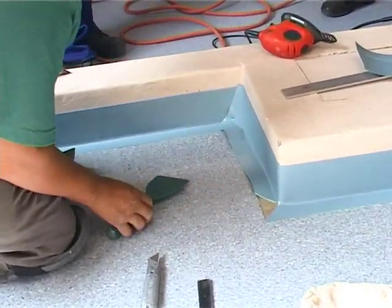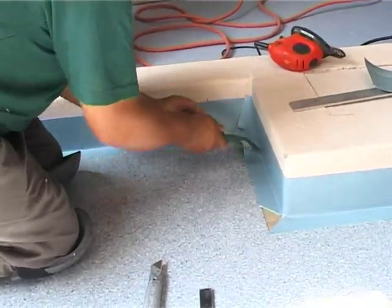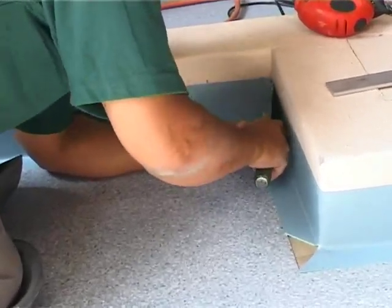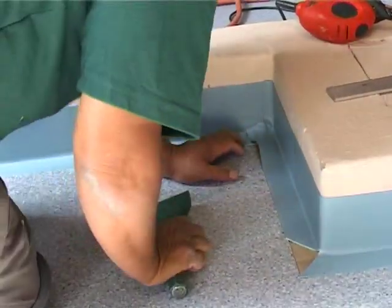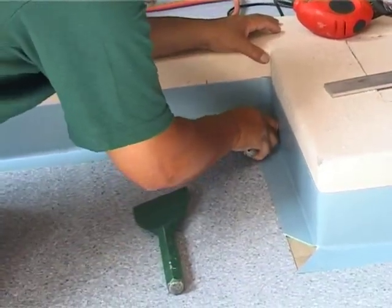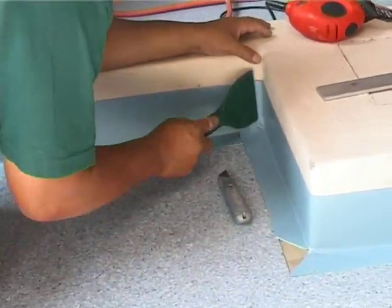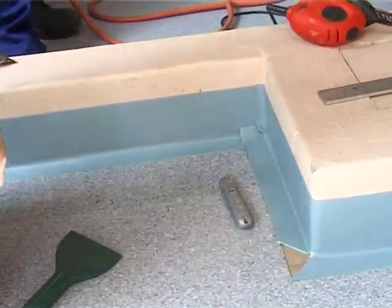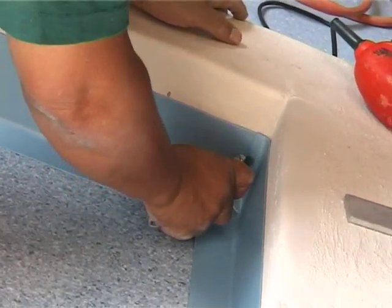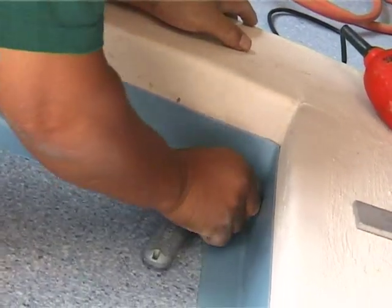You will see from this demonstration that a very light whiff of gas flame is applied to get a well-glued join, and at the internal corner the vertical part of the skirting is trimmed with a 2 to 5 mm overlap, which can later be sealed and will ensure that you have no gap in the corner. The internal foot will be trimmed as shown before with a small steel straight edge to give a tight close butt joint.